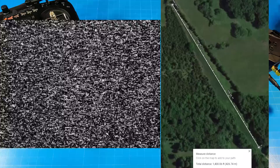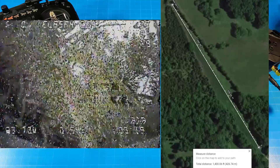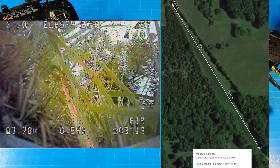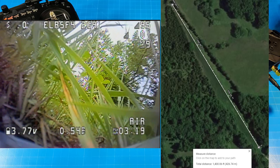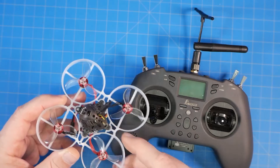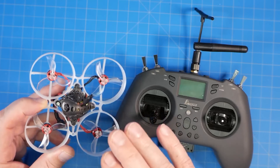Here's about the point where it starts to come back, and we're actually really pretty close — we couldn't be more than 50 meters away when we start to get some video back. Then it starts to become more clear as we walk around the corner. So, 200 milliwatts gets us quite a ways line of sight, but once we get buried behind some relatively thick and probably very well-hydrated greenery, it's not going to penetrate that very well. It would probably be better around buildings and structures that don't have so much built-up moisture. The video is nice and clear. I think my son picks it up here in just a moment — yeah, I'm checking the goggles. There's him.